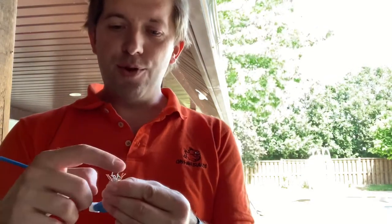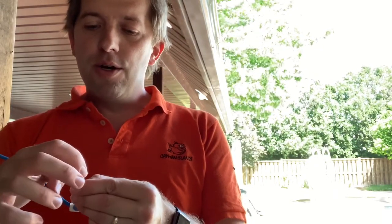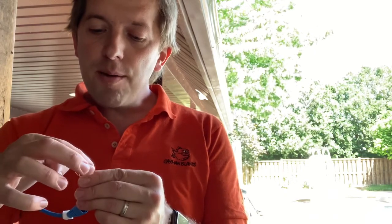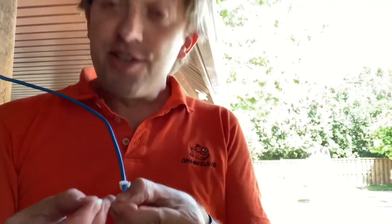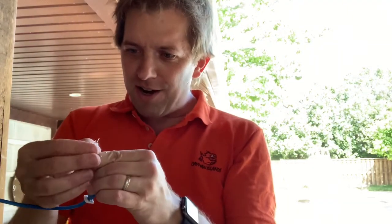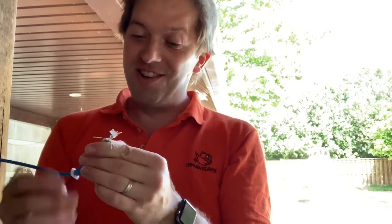So when you're terminating the ends of the cable, it doesn't really matter whether you're using 568A or 568B, you just have to do the same on both ends. So I'm doing 568B: orange stripe, orange, green stripe, blue, where's my goggles? Blue stripe, green, brown stripe, brown. There we go. If you're a true techie geek, this is the ultimate geek test. You can terminate your own Ethernet cables. Yeah, my eyes are not what they used to be. This is harder than I remember.